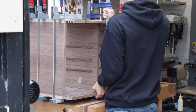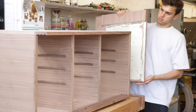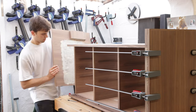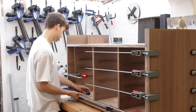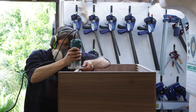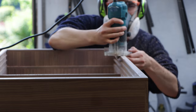The storage unit is made in a few stages. First it's the main unit, but after it's glued up I'm going to glue on a larger panel on either side to act as a leg, raising the unit off the ground. I also glued on a large rail underneath to stop it from sagging, made from veneered MDF with lipping on the bottom. Throughout the full length there are three legs, but because the unit is in two components for transport, the centre leg is halved between both — the two outer legs are 40mm thick and the two inner legs 20mm, joining to match. Once the whole cabinet was glued together, I added a chamfer to everything using a bearing-guided chamfer bit in my trimmer, then sanded over all the chamfers to remove any burns and tear-out.